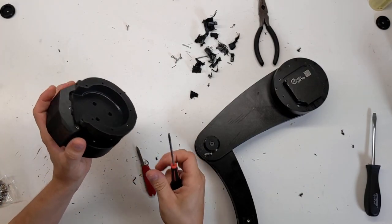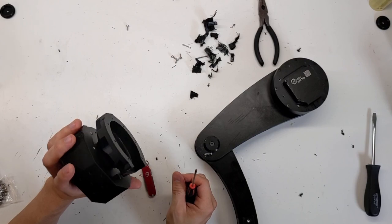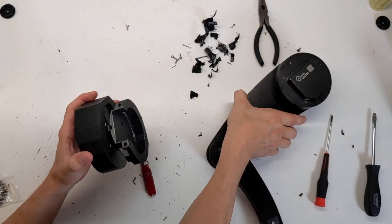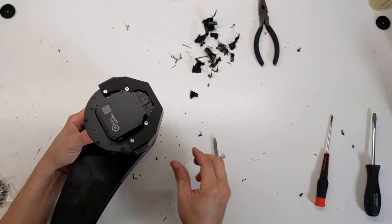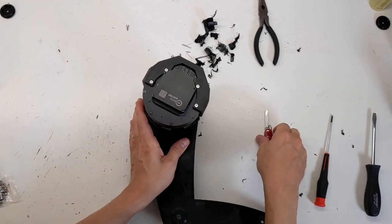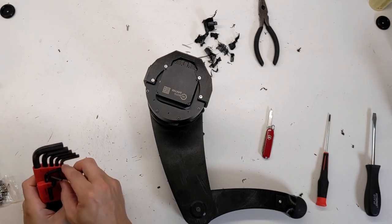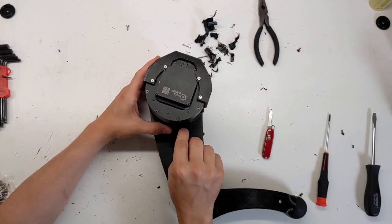This round interface is what I'm going to have to switch back to on the shoulder as well, which will just add a little bit more support at the bottom. So there's that — now this attaches to the knee motor. This uses 7 of the M3x7 bolts, and as with the Quad A1's version, we have to attach those with an L wrench or Allen key, which is annoying.